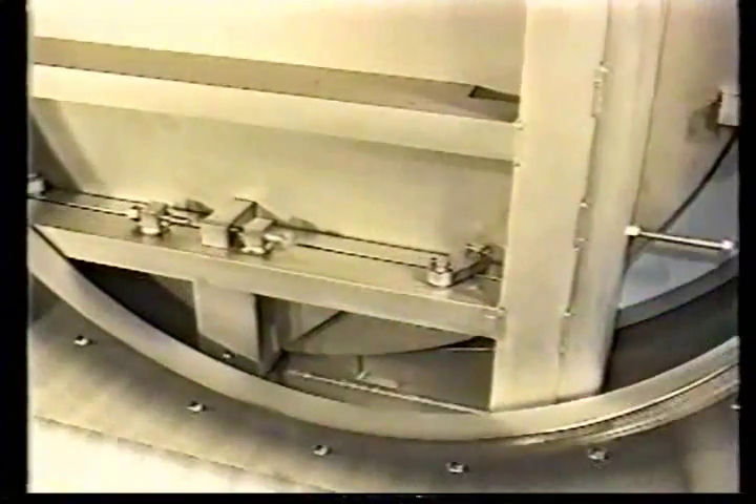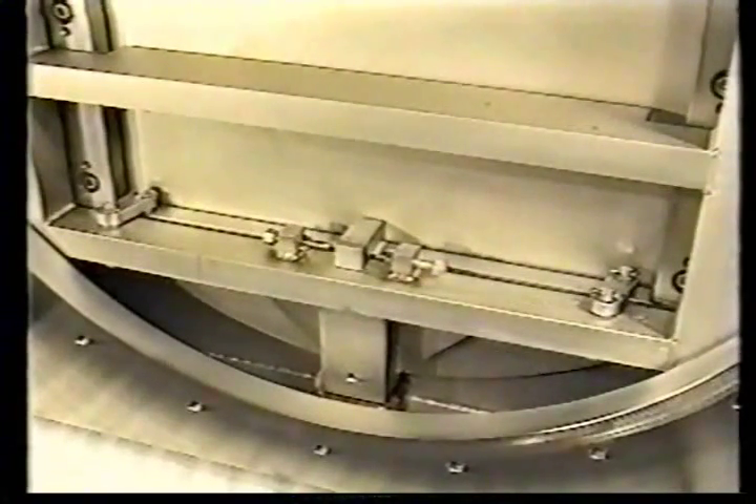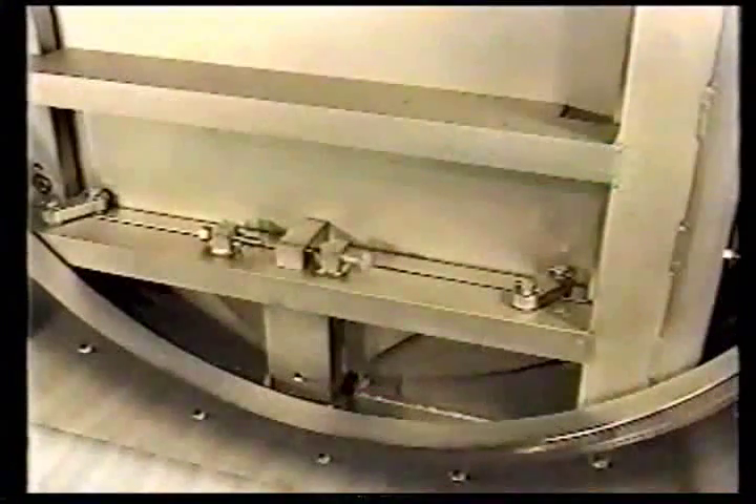The center gate wheel is attached to the gate plate or gate frame. The wheel will come to rest directly over the wheel slot. In some valves, there is a pocket which is machined into the body flange. In some models, the gate wheel may ride on rails, in which case the gate wheel will rest in the gap between the rails. In either case, the wheel pocket or rail gap will be located directly on the horizontal center line of the flange diameter.